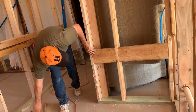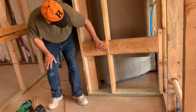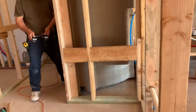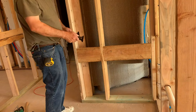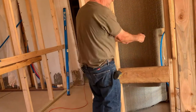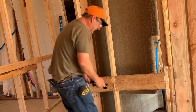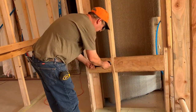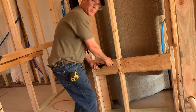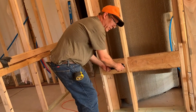Now we have our backing right here, if you follow what I'm saying. When we put the sheetrock on, this block will be there. Here's our toilet paper holder. How many times have you gone and used the toilet paper holder and people screw it onto the walls and it breaks off? Because there's no backing. But when you screw it on right here, after the sheetrock's on, you have total backing. It'll be solid, it won't break off. It'll be stout.